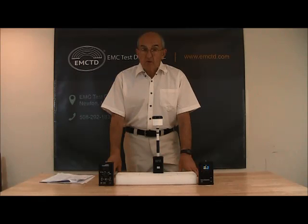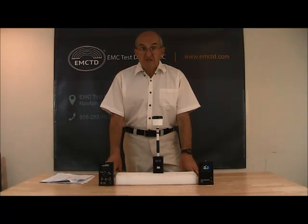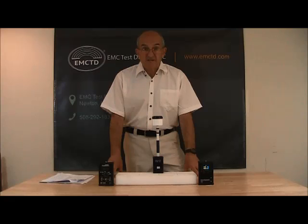There is more and more data demonstrating that not only thermal effects are harmful for humans, but also pulsed electric and magnetic fields are harmful. Therefore, having probes that allow measurements of the RMS and peak value of pulses becomes very important for correct assessment of health risks. All probes are calibrated in our EMC test lab and come with a calibration certificate traceable to the United Kingdom National Physical Laboratory, allowing you to use them and produce accurate RF field strength measurements. Thank you for watching the EMCTD channel.